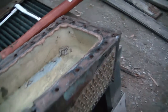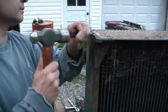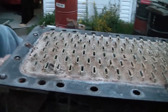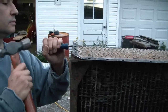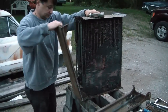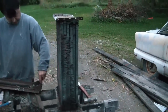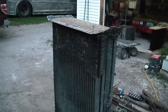We found the broken bolts in the side of the radiator housing are holding the core in. Since we're not using this core again, we're just bending it up so we can get the housing away from the core. We'll have to do this again on the other side. It's starting to get dark and we have this all broken down. Next we'll have to take these — the same tanks — clean them up and get them ready for the new cores.